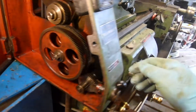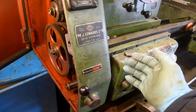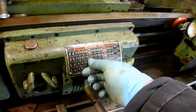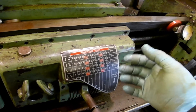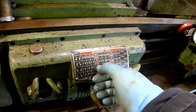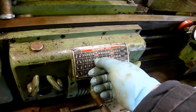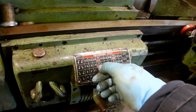What I was finding was, although my English threads were coming out bang on the correct pitch, the metric threads were coming out at a longer pitch than they should. For instance, the 1.25mm pitch thread was coming out at more like 1.29. When you do the maths: one inch is 25.4mm, so cutting 20 TPI gives a 1.27mm pitch. The gears in there are 127 and 125, so that's the relationship between them.